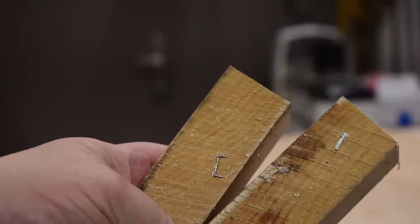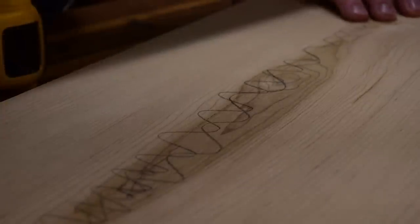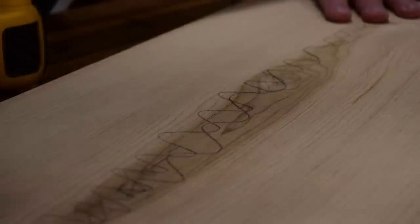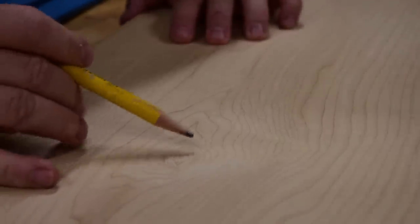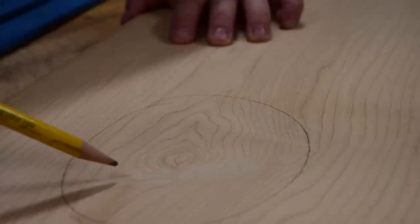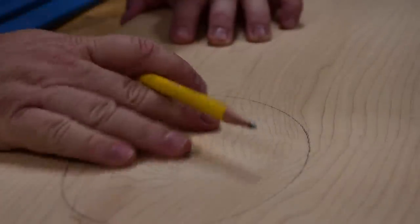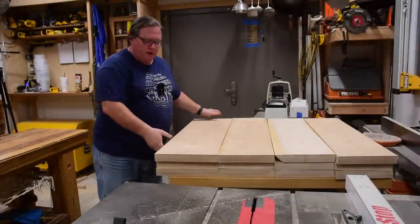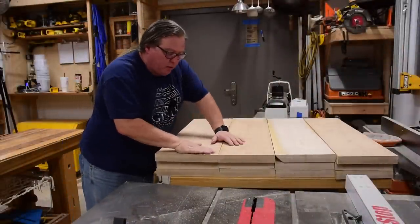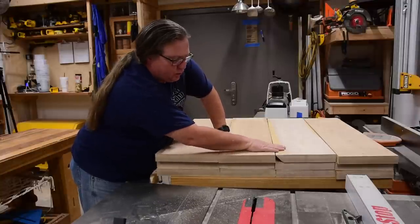Staples are another reason why I always cut off the ends. Other things to look for: right here I have some splits — this is either caused by drying error or just the tree split. That's something I have to watch out for both when going over power tools and it will probably be thrown away for top lengths. Also look right here — see how the grain is circling around that spot and the color changes right there? That means this area all around here is not going to return my best tops because the grain is flowing different ways, so there's less equal density throughout this section of wood. I'll probably make a top out of it but it'll probably be a little bit of a wobbler.